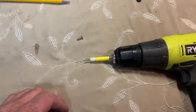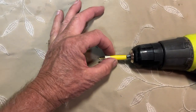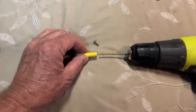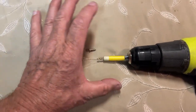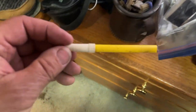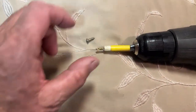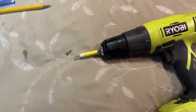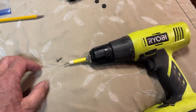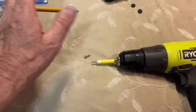I thought maybe you'd like to know one of my little tricks for drilling screw holes to the right depth. I just put a little collar on there — and where did I get that? I sawed this pin off. I know they make little collars to do that, and I've got them at home in my workshop in Mexico, but here in the motorhome I had to make do, and it works perfectly.